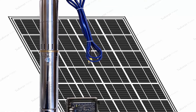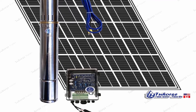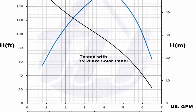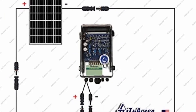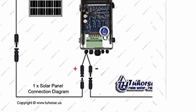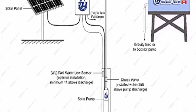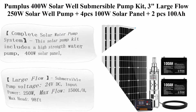90 feet: 3.2 GPM, 120 feet max. 2-inch pump fits 2-1/2 ID and larger well. 1/2-inch NPT discharge outlet. Control box DC input, 3-phase output, soft starting. Pump net weight 8.5 pounds, lightweight and easy to install. Permanent magnet brushless motor, stainless steel 304 pump and motor enclosure. Includes 1x280W A-grade solar panel and 80 feet submersible wire.